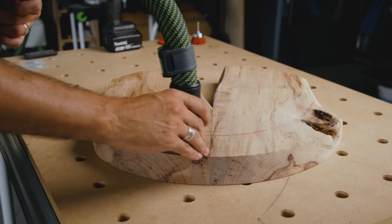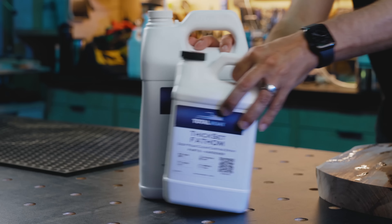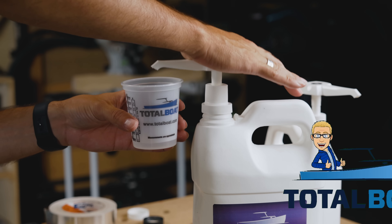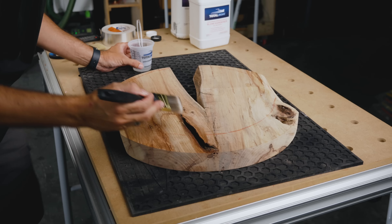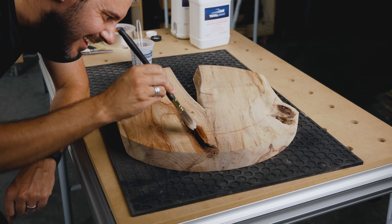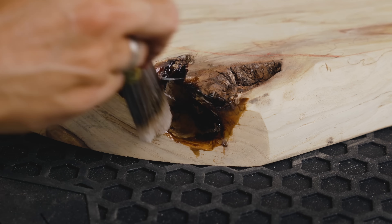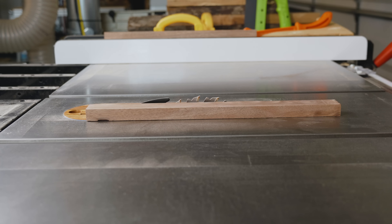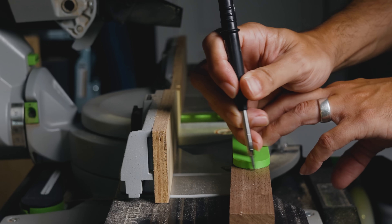I've been making videos on YouTube for about three and a half years now, and I'm officially an official YouTuber — not because of a play button, but because I'm finally going to try epoxy for the first time. Since I'm an epoxy virgin, I asked four different woodworkers with lots of experience how I should approach fixing the top. All four told me the exact same thing: seal the areas needing epoxy with a thin coat of Total Boat High Performance first to eliminate bubbles, then after it's dry, do a deep pour on top without the high risk of bubbles. And so that's what I did.